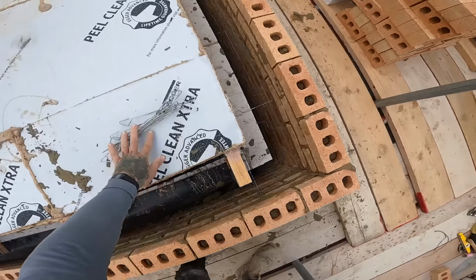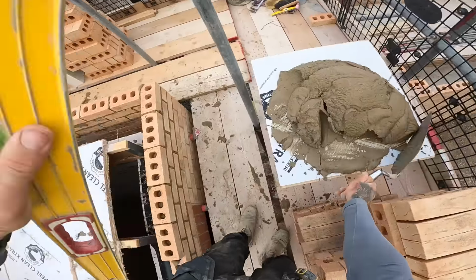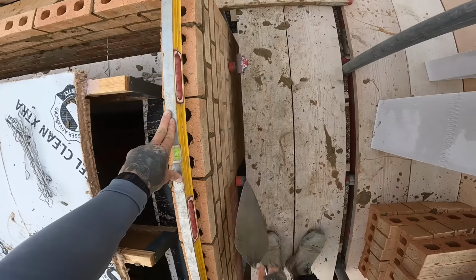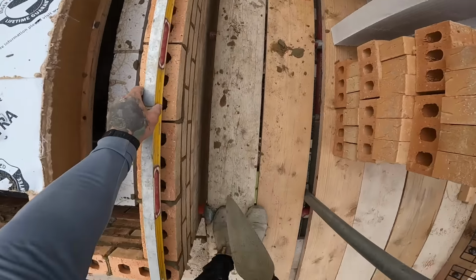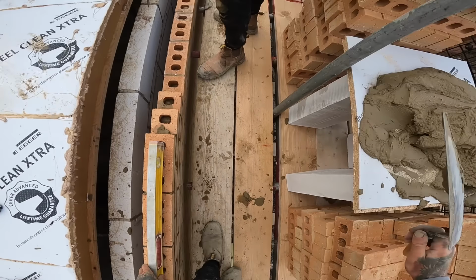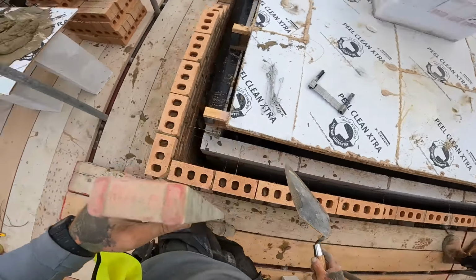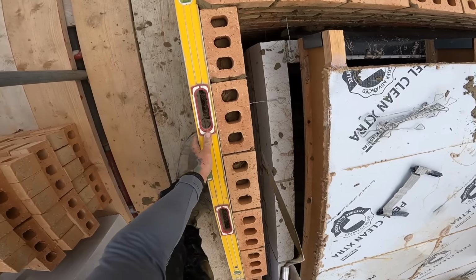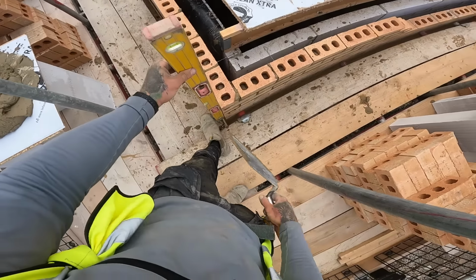So now, I need a few more than that though, yeah? Where was I? Level across the top. Nah, I've got some there. Yeah, that'll do me. Stand the way you're facing, plumb it up, spin round, plumb it up, range it through, climb it up.